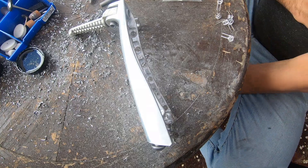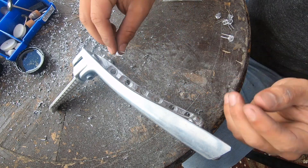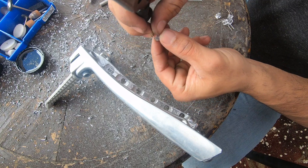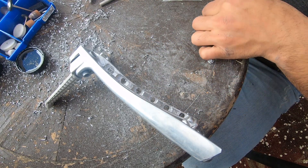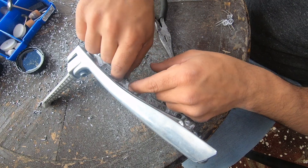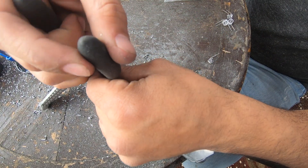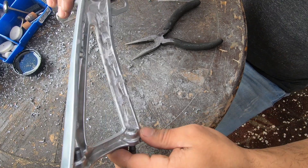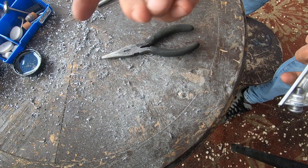I'm done - aluminum everywhere, but I think I'm finished. I'm going to install the LEDs to show you what they'll look like. I grab the LED with needle-nose pliers by the base and fold the leads. Make sure you fold all of them in the same direction - I have the longer leg on the outside so I can solder the resistors while it's installed. A couple of them are going to be a tight fit. When I turn this around it should look pretty decent.